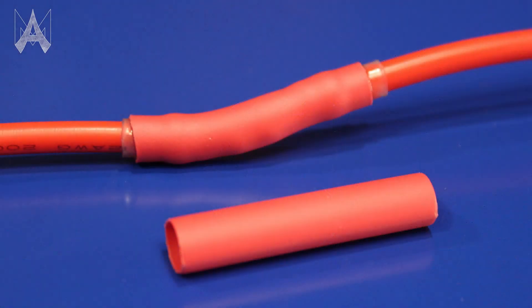Now we're going to look at wire to wire. It is very different than wire to board because you have to make sure the wires are actually aligned, and you don't have the rigidity of the circuit board for structure. You have to use the wires as the structure and usually use shrink tubing to reinforce and protect the connection from shorting out. Wire to wire soldering has primarily been designed out, but in some circumstances you'll still need it — though I'd always recommend using connectors instead.